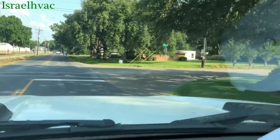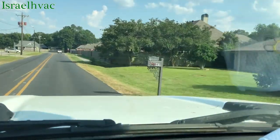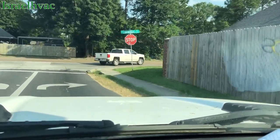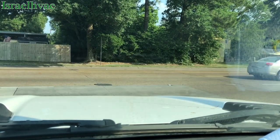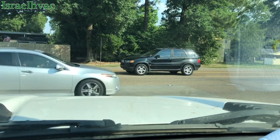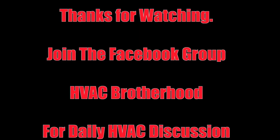There's a 2011 air handler in there. When he replaced the air handler, we told them they needed to change the outdoor unit too, but this is one of our property management companies and they said no, leave it alone. So the boss ran a new liquid line — went from a quarter inch to a three-eighths inch liquid line — and put a filter dryer in the system. They were warned and told, but the bottom line is the dryer is restricted. It's not worth just putting a dryer in. If we're going to open the system up, we need to go ahead and replace the condenser, and that's what we're going to do. Thank you all for watching — we'll see you on the next one.